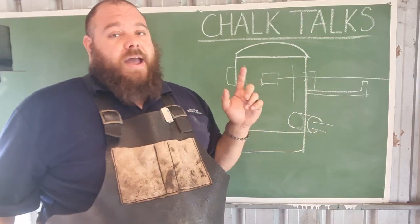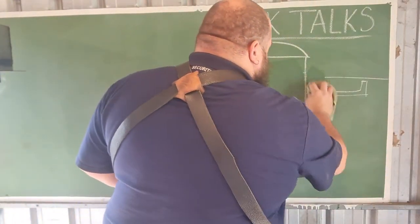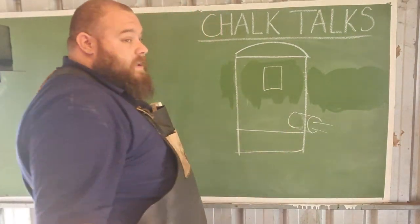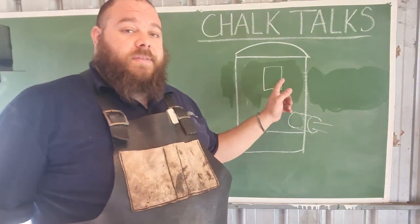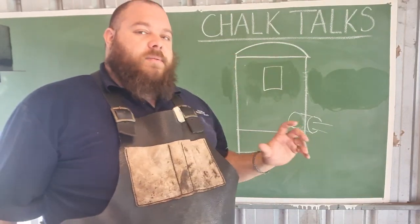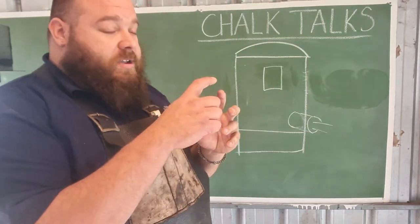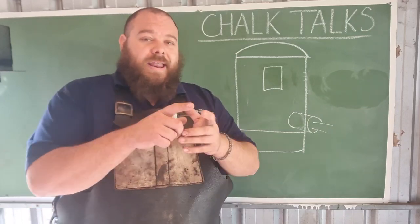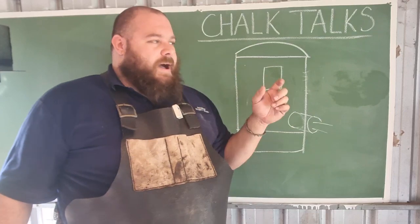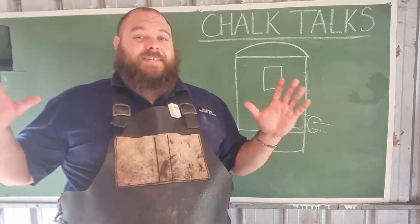The main key disadvantage I've run into occasionally is the size of the doors. The smaller the door the more efficient it is. Some people build their doors tall and narrow like I do; others like Kyle Royer will have it short and wide. But normally you're limited to about a 2.5 to 3 inch by 3 or 4 inch hole — a very narrow opening. Working any wide material like axe blades or large billets becomes difficult; I can fit a Musso bowie in a 3-inch-wide area, but anything larger I can't. I can't work a cleaver in it — I have to use a wider forge door, and that's where those floored forges come in.